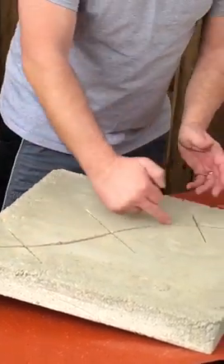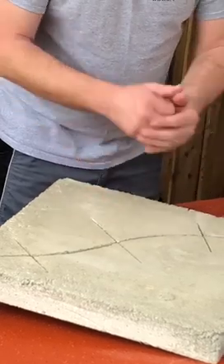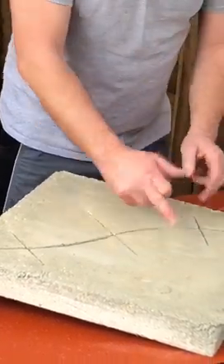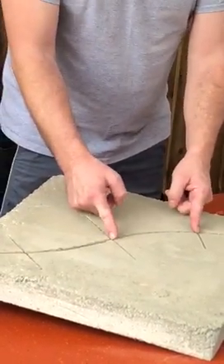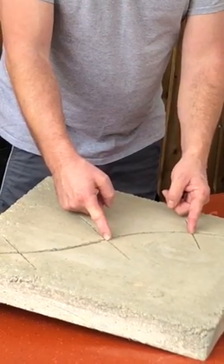I've opened up a little crack with an angle grinder just so it penetrates a little bit better. With this kit you can cross-cut the floor to put some stitching pins in, and it should be cross-cut every 20 centimeters or 200 millimeters.